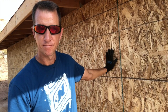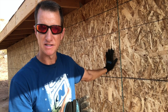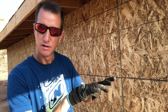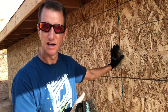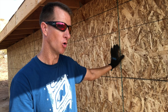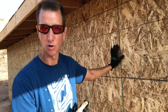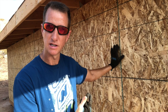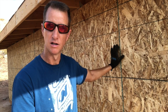So I was afraid of that. My battery-powered circular saw kind of bogs down sometimes — I just don't know if it's not powerful enough. If the wood either binds up it'll kind of stop, and with what I was just doing there, the wood's tight enough that when I try to push it down through, it just bogged down. So I have a couple options: one, I could go get my corded circular saw, which means I'd have to bring a generator up here for power. So I'm going to try the other option, which was the reciprocating saw from the inside, because I have a battery-powered reciprocating saw.